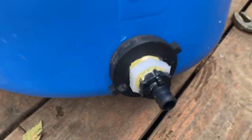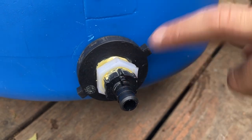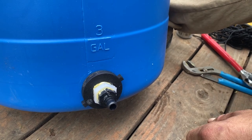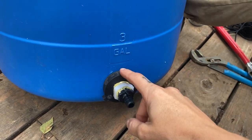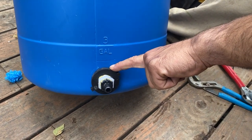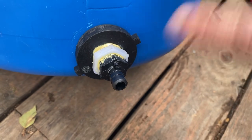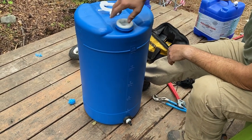We're going to use this tank and integrate it into our water system inside, which is all half-inch PEX. You can use these bulkheads to put regular spigots to turn on and off, but this one is a straight hole that goes into our PEX in the house. We've done on/off spigots for our rain collection systems — for trash cans and food-grade stuff. This black piece is literally the only thing you need to put a spigot on — it's threaded three-quarters on the inside. We've just got a white adapter to bring it down to half inch for our PEX.